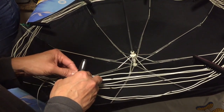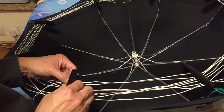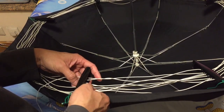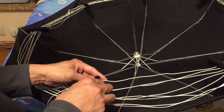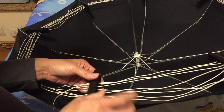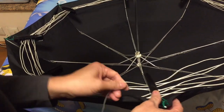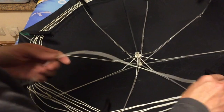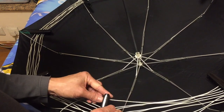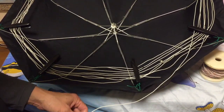This whole loop is detachable — you can detach it from your umbrella and use it as a standalone loop, hanging on a tree or supported with some bamboo, giving you a very good big loop antenna. You can also connect this big loop antenna to replace a crystal radio circuit where you need an antenna and ground. Connect one end to the antenna and the other end of the loop to the ground of your crystal radio, and it will function to replace your antenna in case you can't find one.